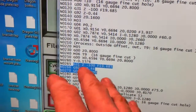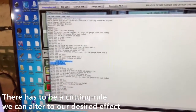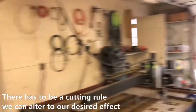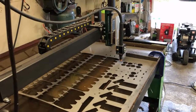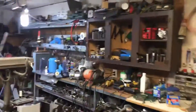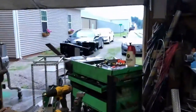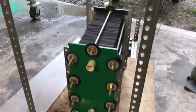If these holes are far apart it will automatically do what I'm trying to get it to do — it's not a problem. But when you're doing arrays, when I'm trying to cut a bunch of parts out in an array, using the minimized distortion does not work, as it did in this case. I was able to cut out some plates for this big monster behemoth electrolyzer right here.